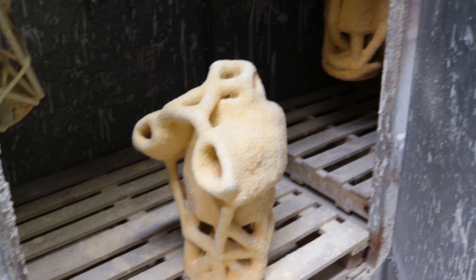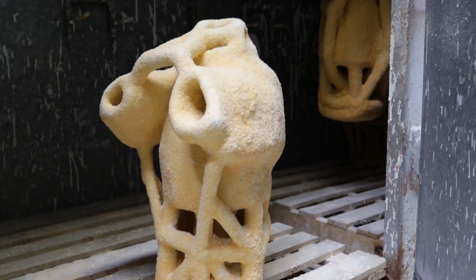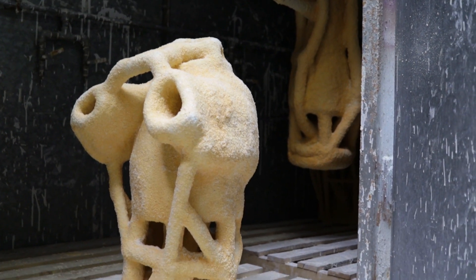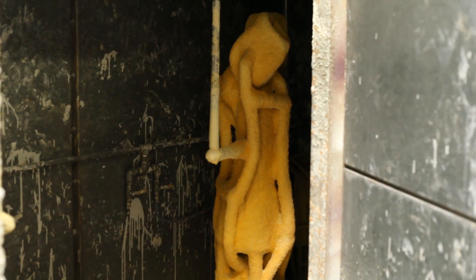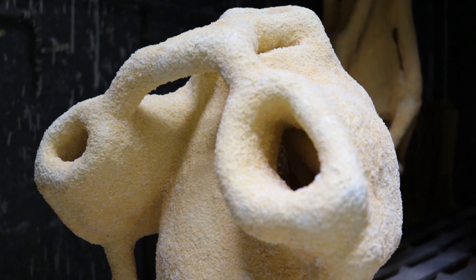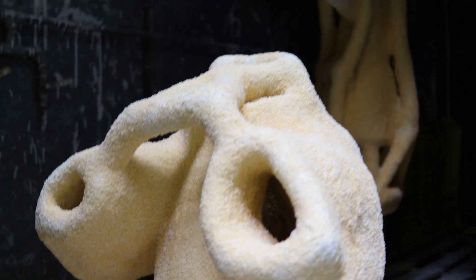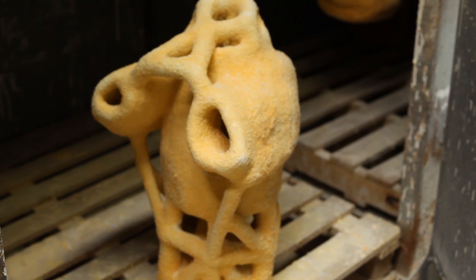This is the cooling cabinet — essentially you want each layer of the ceramic shell to bond to each other very well every time you reapply. So it comes in here to dry off and then it's ready for its next coat. These pieces are about halfway through their process, so you can already see it's quite built up and quite thick. That's the actual object that you want cast and all of the runners and risers, all being coated in the ceramic shell.